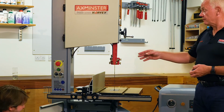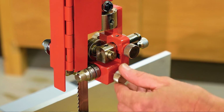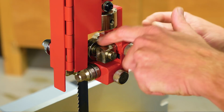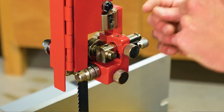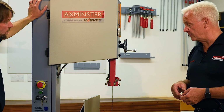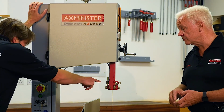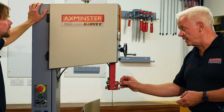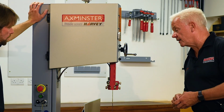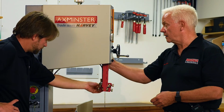Finally, when we come to look at the machine, one of the things which you're always looking at is the blade guide mechanism. This one here has a roller which sits behind the blade and runs in the correct way that a roller is intended to, not across the face of the roller. If you do the mechanics on that, you'll see that you're always going to be failing. And it's also got the groove in the middle of the bearing, hasn't it? So you can just finely adjust it, nip the bearings up, and both top and bottom blade guides are very easy to adjust. And completely toolless.